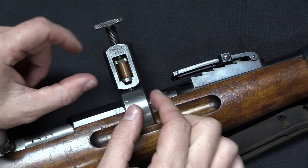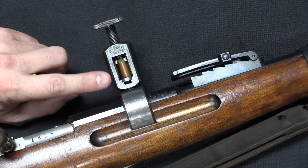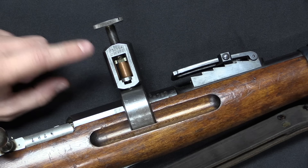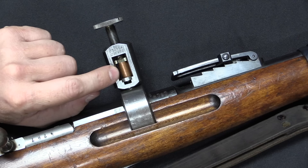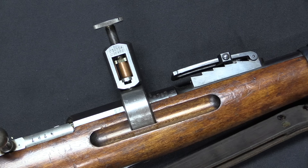You then measure the change in dimension of the copper, and that translates into a unit of measurement which is — quite obviously — called copper units of pressure, or CUP. If you look up old hand-loading databases or old information on cartridges, you'll see chamber pressure described in copper units of pressure, and then typically also in PSI. You'll find references that say there is no conversion factor between copper units of pressure and PSI, and that's because this really isn't an actual direct measure of pressure — it's a secondary measure. The pressure is performing an action, and then you're measuring the results of that action. That's why you can't take some numerical constant and convert from PSI to CUP.